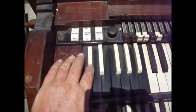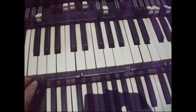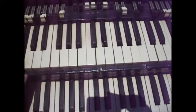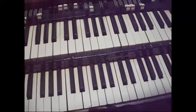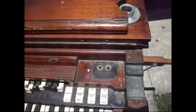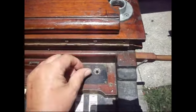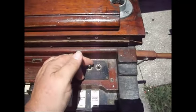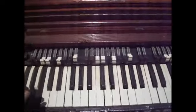That one preset for whatever reason won't operate, but everything else works fine. It seems to have tape right below the top and bottom manual — this could be because the guy was trying to save on paint, or because she has a ground problem and maybe shocks the hell out of you when you're playing it, who knows. Also, the start toggle here usually is supposed to be spring-loaded, and for some reason this one's not.